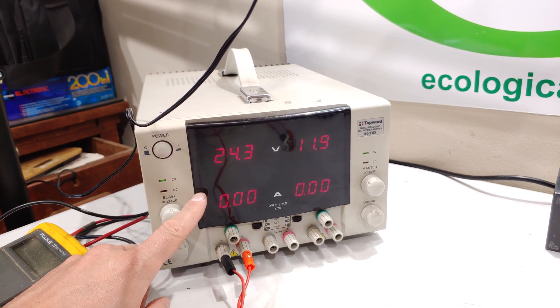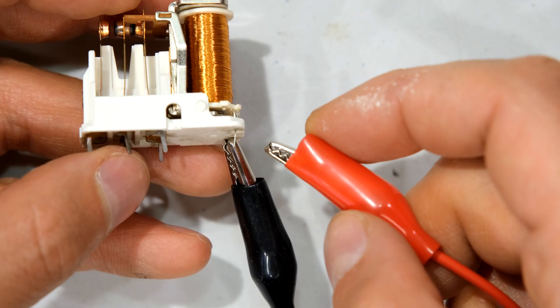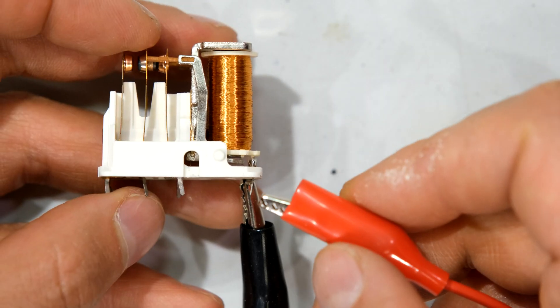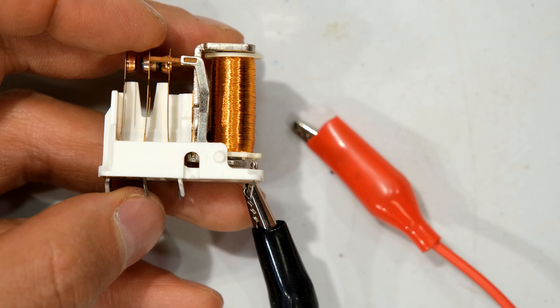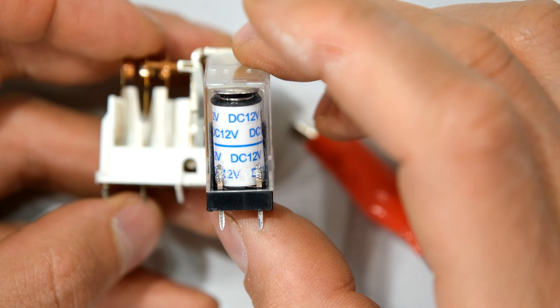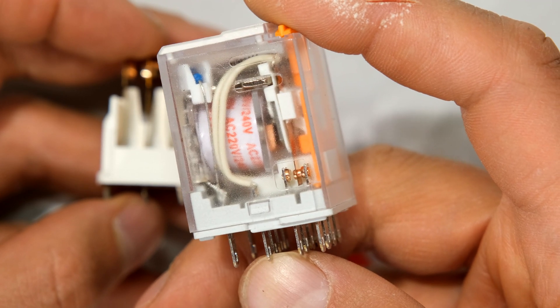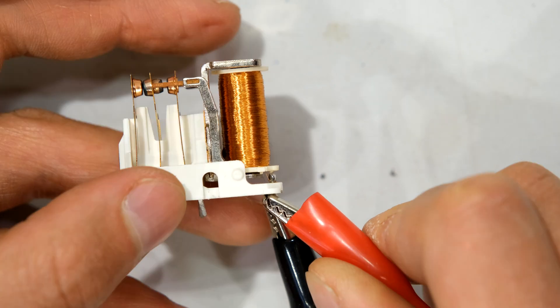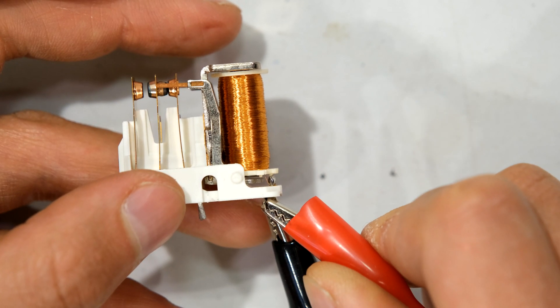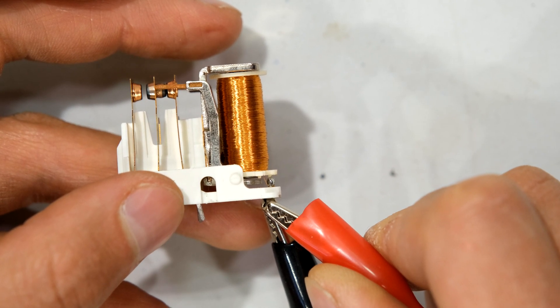Over here I have a DC bench supply and it's been set to about 24 volts. The output of the bench supply is now connected to the relay, so I have about 24 volts between this crocodile lead and this crocodile lead. Notice that when I put the crocodile lead on the other terminal of the relay the relay will energize. The reason why I've chosen 24 volts is this is a 24 volt relay. Some relays require only 12 volts while other relays require an AC voltage. For example, this relay requires a 220 volt input to activate. Now when I attach the lead you can see how that electromagnet is activating, magnetizing the coil, creating a magnetic field and attracting the platform to that rod.